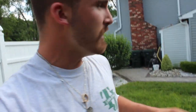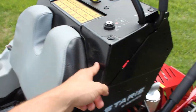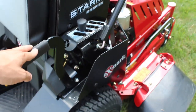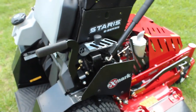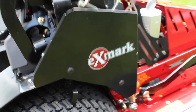I will tell you one thing my dealer told me — and I don't know if this is common with a lot of mowers — but I have two John Deere Zero Turns, and when I put it at four on the deck, that is four inches. My dealer told me that is not the case with this Exmark. Just because you put your deck pin at four doesn't mean you're cutting at four. The deck goes in quarter-inch increments. Right now I have it at 3.5, and when I'm cutting it looks like four because on my John Deeres when I have it set at four, this is like the same height. So when I cut at 3.5 on this, it stripes beautifully, and I believe that's actually four inches — but don't quote me on that.